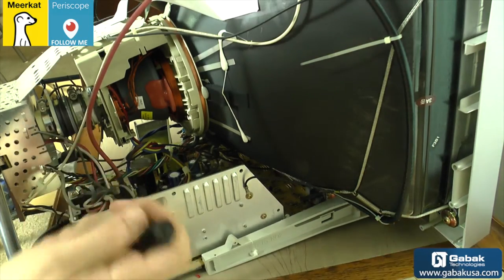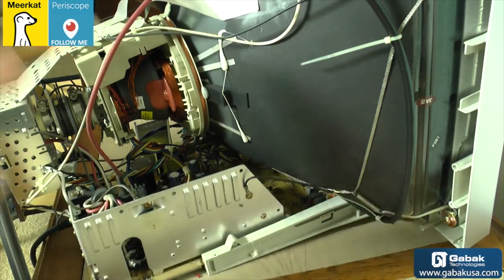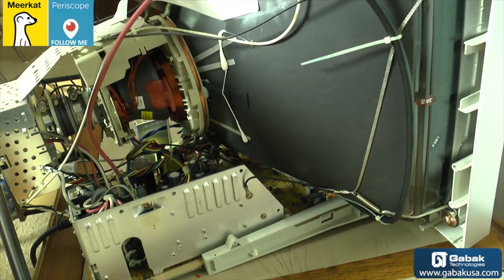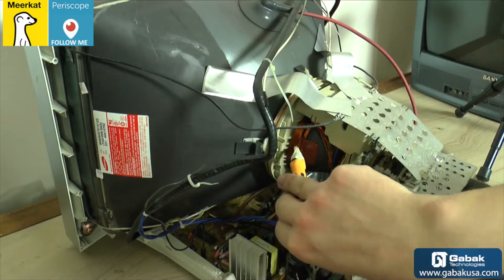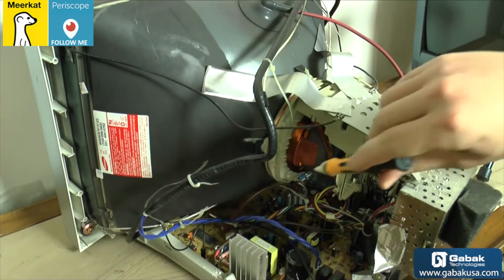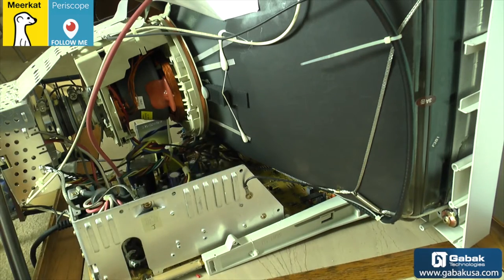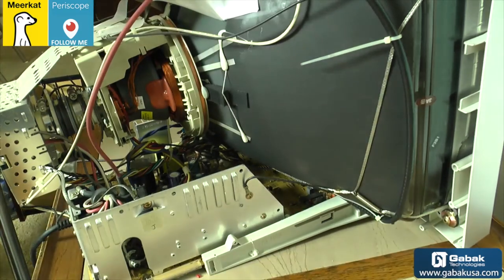Here you can see a screw. If you want to remove the deflecting coils, when you unscrew this screw or if you move the deflector coils, what you are going to find is that you can move the image. Also, if you have some issue with the electronic component, you will see just a straight light — that is what the deflecting coil does.